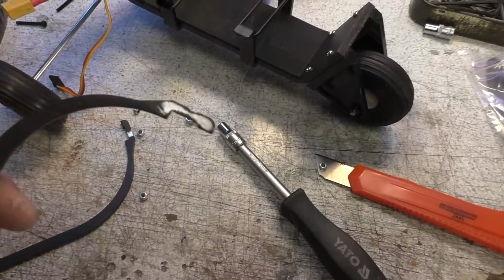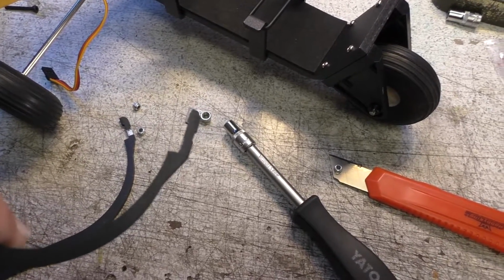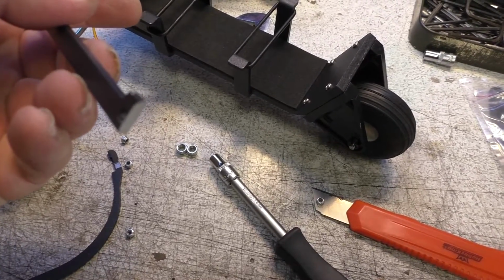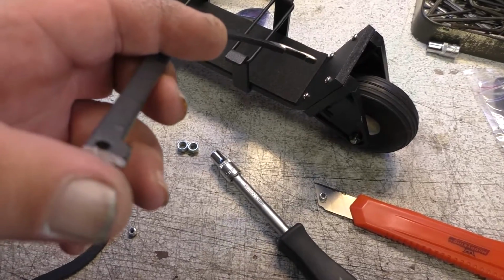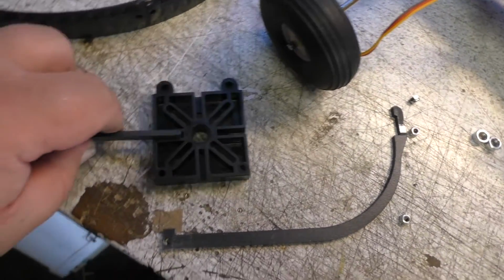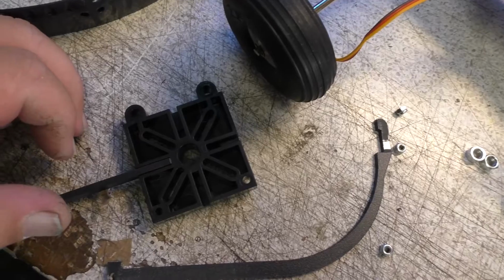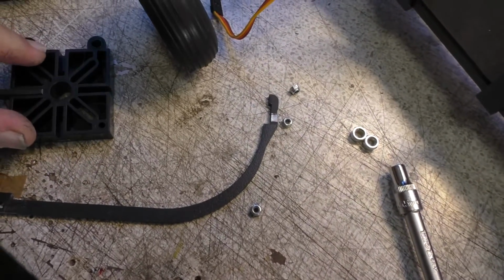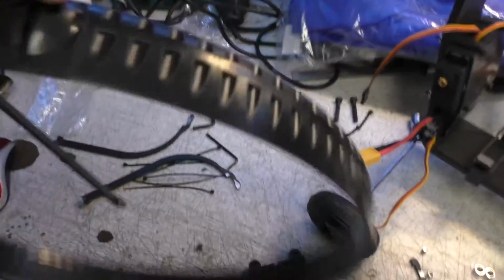So back soon. Right, my fettling is done. I've had to take a bit of the powder coating off there, and also at this very far end as well. These are basically stamped out, and so you can get a bit of a taper on them, and where that's happened, it's made them a bit long and they didn't fit very well into this block here. So now they should all slot in lovely jubbly, just like that. That's good, and now they also fit into the shroud as well, which is also good.